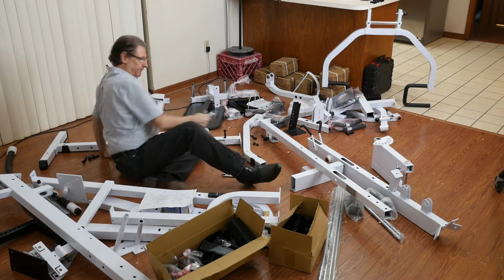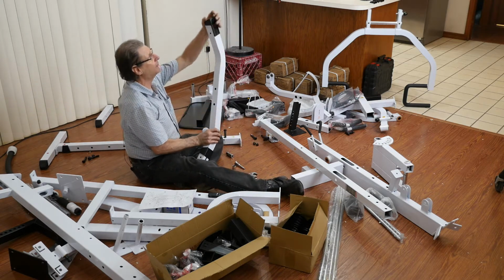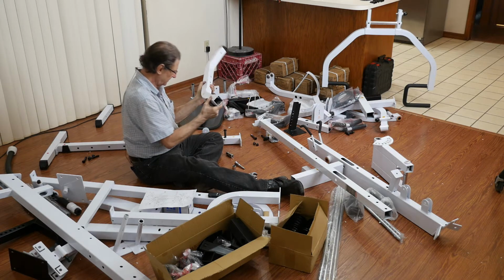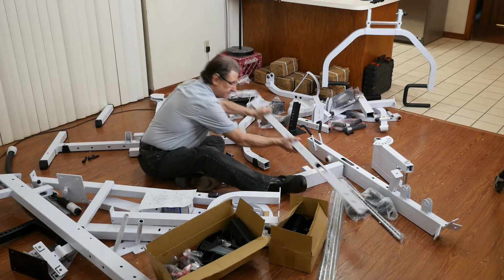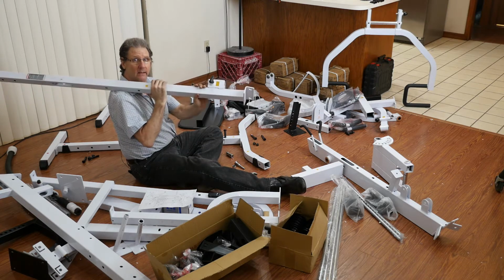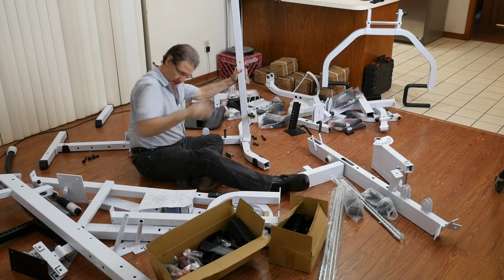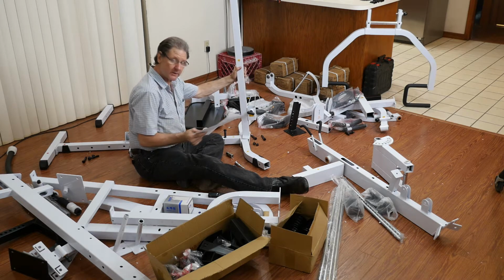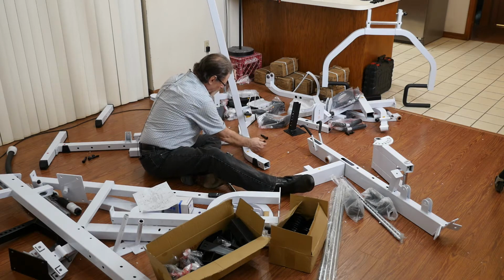Next is a little tricky. This piece has got the full slide-in foot here, the open foot here, because that metal thing is going to go in and pocket in. But it also does something I don't like. It ties in with this piece. Can you guys see that? The L shape. This is back to half inch fasteners, and they are 3¼. These are the ones slightly longer, because you've got two flanges. 3¼, no washers.